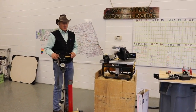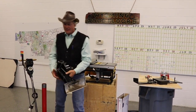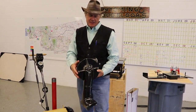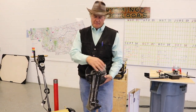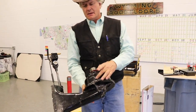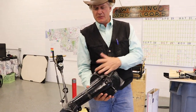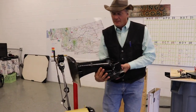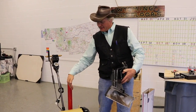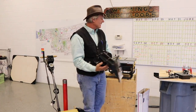Next, let's talk about the fan housing and dust pan on this machine. When it came originally in the 1950s, they just put a little nut and bolt through there, but it's really difficult to get at. So we've taken this, put an additional little piece of aluminum there and threaded it, so we're able to just thread in a socket-headed cap screw. It sits right under the motor and you've got to reach your hand in, but it's a lot easier with that socket-head cap screw.